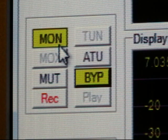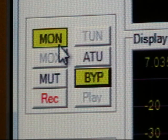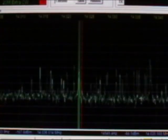Lower DSP settings will reduce latency, however the transmitter frequency response will change. Lower buffer settings create broader transmit signals. Audiophiles typically like the broader response because it provides warmth in the transmitter sound. But during contests and other crowded band conditions, one should use higher DSP buffer settings.